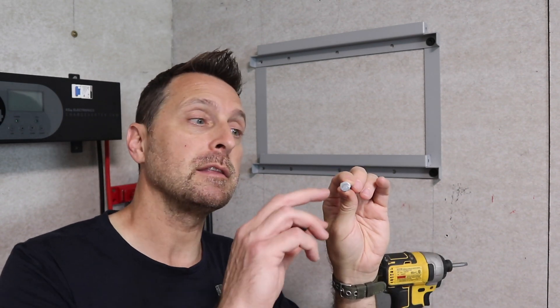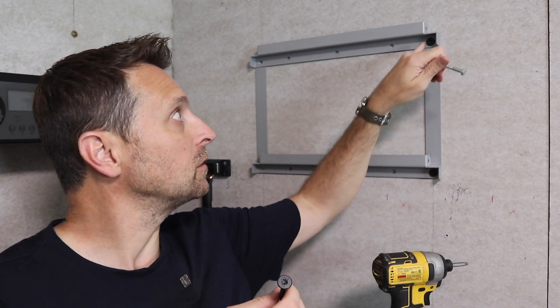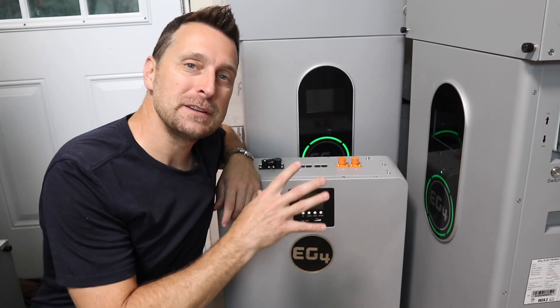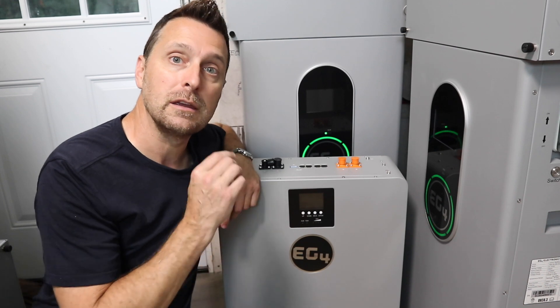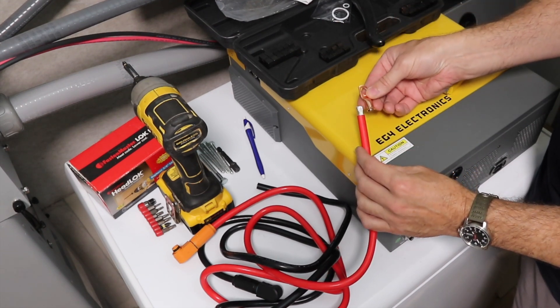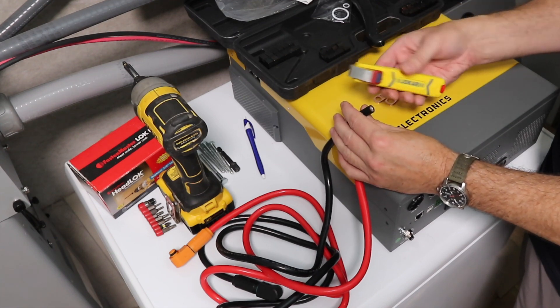In putting this bracket up on the wall, here's a quick tip: lag screws are great, but the head on them is kind of small. What I like to use are these structural screws — they have a much wider head on them, and when going into the mounting holes on your brackets, I think it holds much better than a lag screw. If you can find shorty structural screws like this, go for it — I'll leave a link in the description below. If you're interested in solar products like these, I have a special coupon code in the description. I also have listed every tool and every part and piece for our entire system, so check those out too. To attach these to our external bus bar, I'm going to put lugs on them — some four gauge lugs — using a really great cable stripper, which I'll also link below.